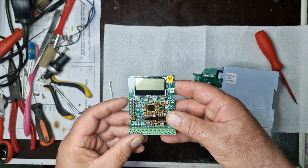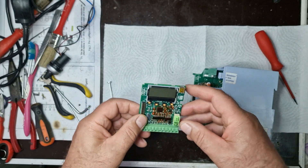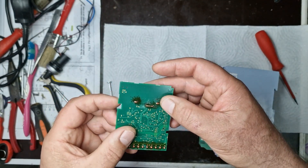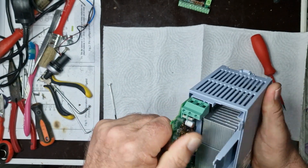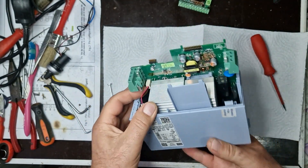In the first stage, I perform a detailed visual inspection of the board looking for obvious signs of damage: swollen capacitors, burnt resistors, affected printed circuits that are delaminated, burnt, or showing signs of smoke, and damaged contacts.